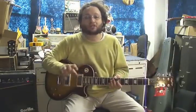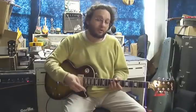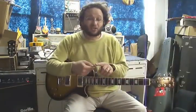When you have a humbucking pickup that's got a four conductor lead, there's a lot of stuff you can do with it. You can do coil splitting, where you cut off one of the coils and have a true single coil sound. You can do phase switching, which is basically where you can have it sound nasally or in phase where it's full sounding. Or series parallel.